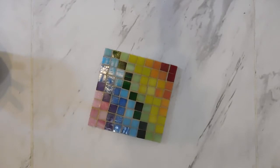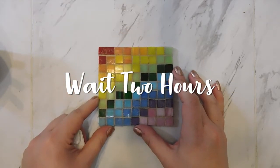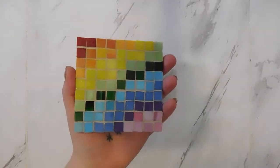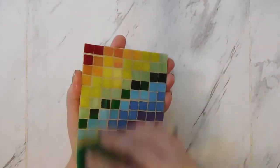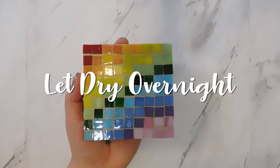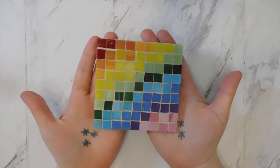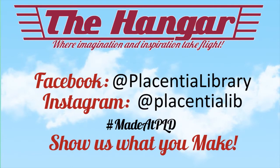Take your paper towel and give it a good wipe. No matter how well you clean it during this stage, there will still be a little bit of a grout haze that will develop on top of the glass. So we're going to wait about two hours to give the grout time to make its little haze. Then one last time, take a wet clean sponge and just wipe off the surface of your tile. And that's all there is to it. We're going to let this dry overnight before we use it — that's how long it takes for the grout to set up. Your tile will probably look a little different from mine depending on the tiles you get in your kit. I would love to see them — please post them on social media and tag us. See you next time.